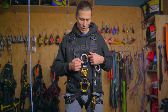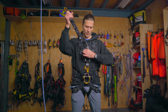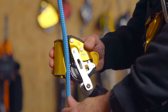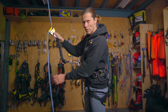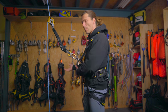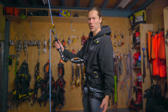It's a backup device, so it always gets attached to the harness on one of the points marked with an A. This one has an A, the one on my back has an A. I open the carabiner, attach it to my harness, open the cam, put the rope in, close it — it slides up the rope, rolls down the rope. In case of a sudden fall, my main line breaking, or stepping off a beam, it blocks and you're safe.